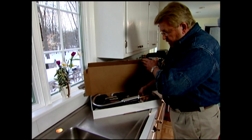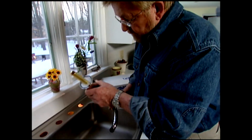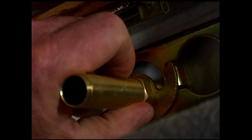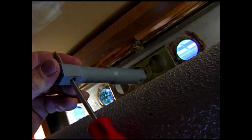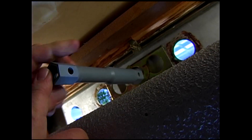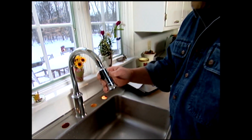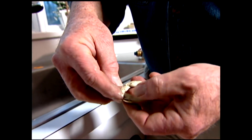The first step in installing the new fixture is to place a rubber O-ring on the faucet base, then insert the lower end of the faucet through the sinkhole. Underneath, I slip on a mounting plate and washer, followed by a retaining nut. This plastic socket wrench comes with the fixture — to get the leverage I need, I insert a screwdriver to use as a handle. I then insert the spray nozzle hose into the end of the faucet, push it all the way through and out the bottom. This faucet has individual valves for hot and cold water. Plumber's putty will make a watertight seal at the valve base, preventing water from dripping into the cabinet below.